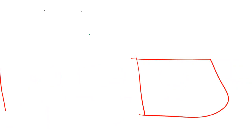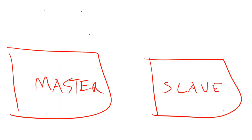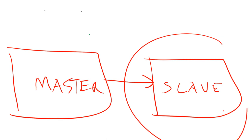Without the clock signal, the slave device, that is the device that's not controlling the bus, will not receive any commands at all. So most serial protocols have a master-slave relationship where the master controls whether the slave is listening or responding, and it sends all the commands. The slave usually won't engage in conversation. It will only respond. Because there are very big differences in the way master and slave devices handle their protocol, it is really important to have separate implementations for their bit banging, and usually you wouldn't bit bang a slave.